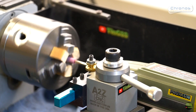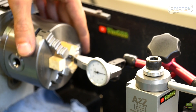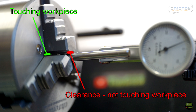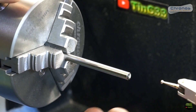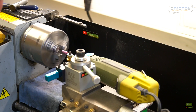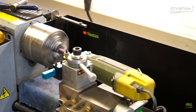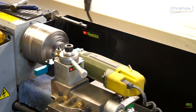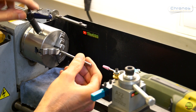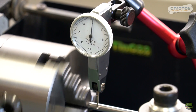The stone is now dressed, so I can load the jaws and grind them — but not too much, just a hundredth or two. Every jaw shows perfect zero now, but when I clamp a piece across the entire jaw surface I have an even bigger problem with jaw parallelism — even more clearance on the front of the jaw surface. That's because I loaded the jaws only on the front, but the snail gear pushes them from behind, so the clearance in the chuck grooves allows the jaws to tilt slightly. I tried a few different approaches, and in the end got the best result with the simplest method: I just loaded the jaws freely in the chuck, set a slightly higher RPM so centrifugal force pushes the jaws out, and then gently grind. With that process I got super parallelism. With gently tightening, the jaws clamp the workpiece across the entire surface, and the gauge shows one hundredth out of center. That's the best I can do and I am satisfied with the result.